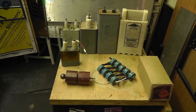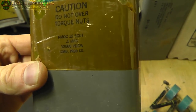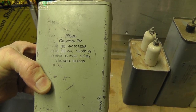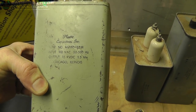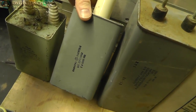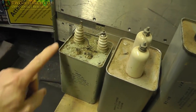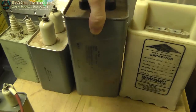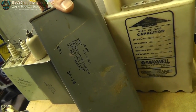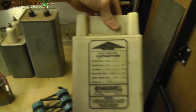We're going to get started with the capacitors. I have a couple that David gave me. This one is 12,500 volts DC at 0.1 microfarad. This is a 118-volt input, 15 kilovolts DC output at 1.5 milliamps — this is a high voltage transformer, which actually might be what I need. This is a 0.2 microfarad 6000-volt DC capacitor, internally rectified. That's actually really nice. And this one is 900 or 90 microfarads, though I do not know what voltage it is — it does not say.